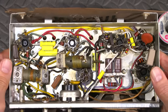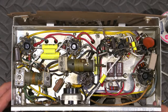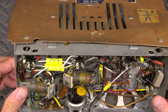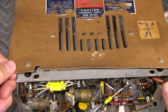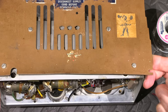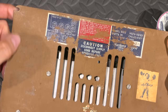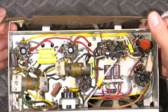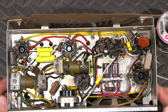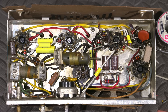As I say, they were really thinking when they put this thing together. That is a nice touch, that they soldered the screws to the nuts there so that you can't lose the back. Even the actual screws that hold the chassis in are held by the back of the radio. So when you put the radio back into the case, it's held by this, again, insulated. This holds the entire thing into the case. So pretty interesting. One of the safer designs of the All-American 5 type of radio for way back when.